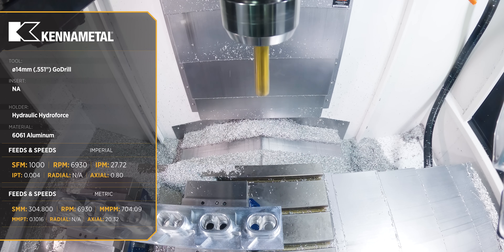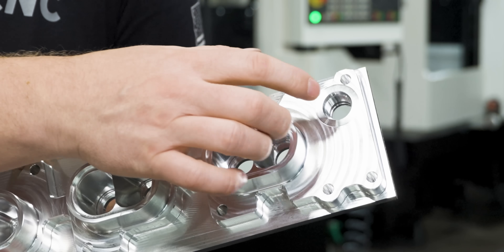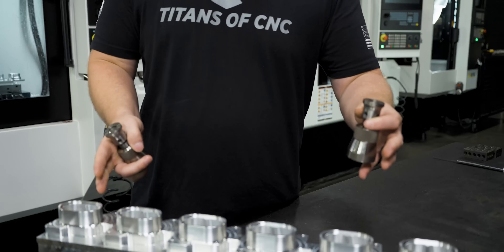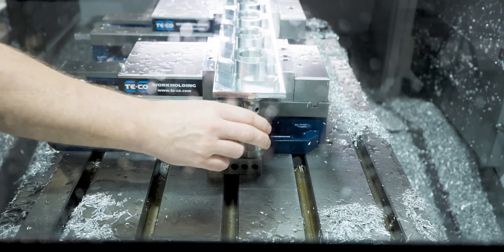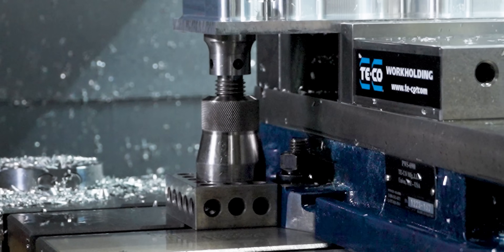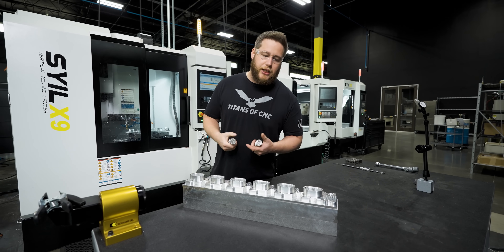Next tool coming in is a drill to pre-drill this hole. I already had this drill in the machine from when I made the soft jaws for the second op, so I'm just utilizing it to pre-drill. After drilling that hole, I'm going to put jack screws up under each end of the part — it's kind of hanging off on both sides of the vise. This might be a little overkill on this side, but on the base flange I used these because it got so thin it was trying to chatter. I mainly want to support the left side because when we come in with the porting tool I don't want it pushing that material, so I'll support that end — and since I've already got one out there, I might as well throw one on each end.